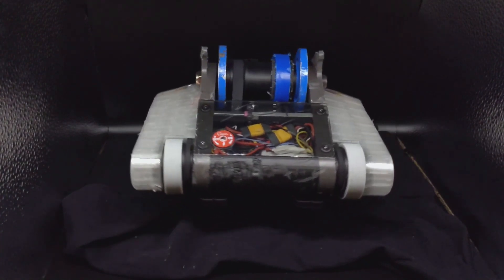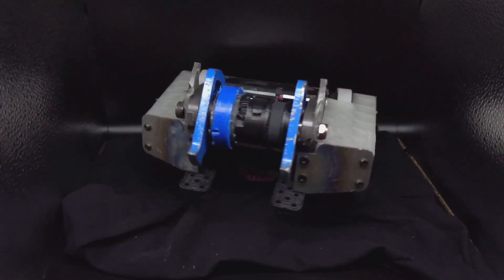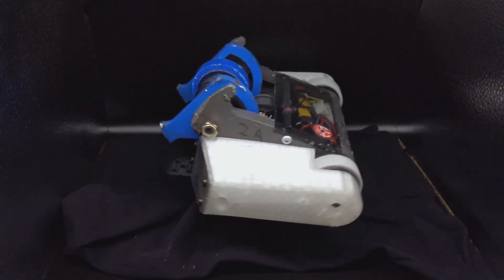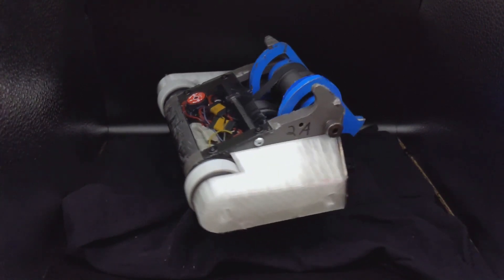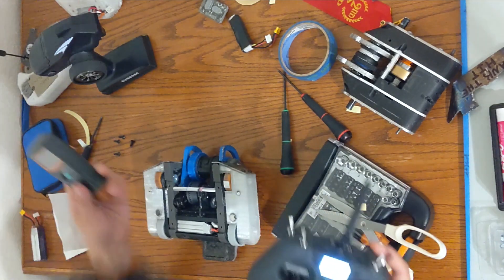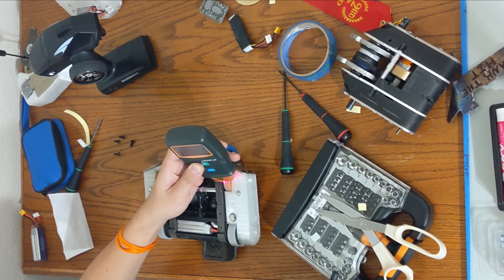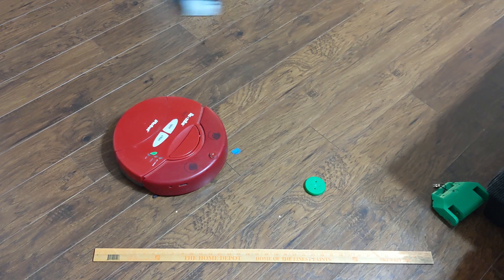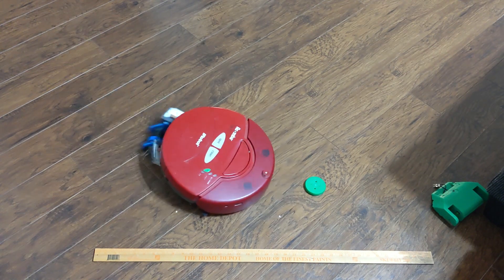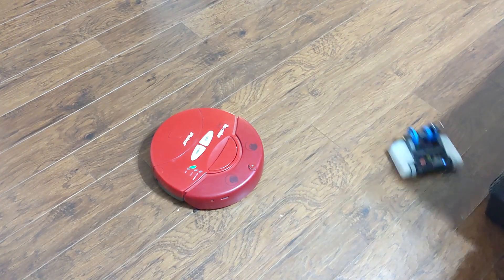This is New Hound — an upgraded and more powerful version of Old Hound. The drive stayed pretty much the same: exact same drive motors running the same voltage. However, these are going to much smaller 34.9 millimeter polyurethane Banebots wheels. Running at the same 1,400 RPM, that drops the drive speed to 2.5 meters per second — a lot slower, but a lot more controllable. I like that a lot better on this version.